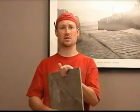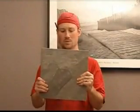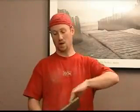Durability is good with them, and that is a big bonus. Very, very, very durable tile. Now, when you're laying this tile, you want to once again use your 1/2 inch by 1/2 inch trowel. Quite heavy. And the biggest thing is, if I show you this side, and then I show you this side, you probably don't have a great idea of which one's the top and which one's the bottom. They're both really bumpy, up and down, and another reason for the 1/2 inch is it allows for all of those imperfections in the bottom. So if you do have a lot of ups and downs, no problem. You have some play with the 1/2 inch trowel. So don't use anything less than that.